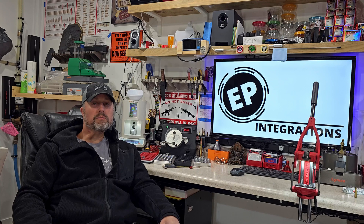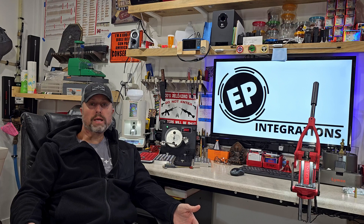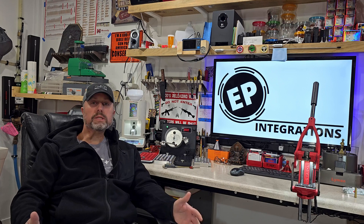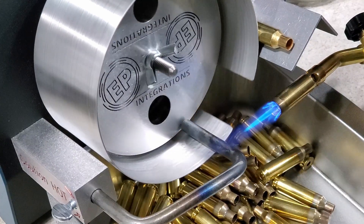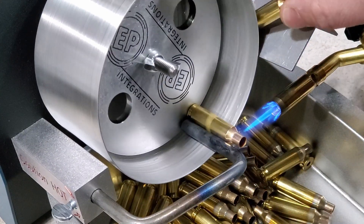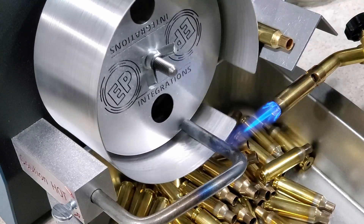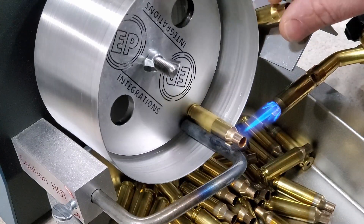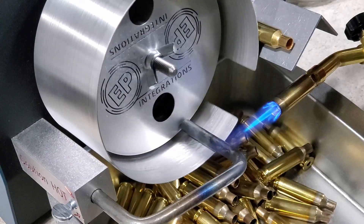In the grand scheme of things, from start to finish of your reloading process, it really doesn't take that long. For example, your average piece of brass getting annealed takes roughly about six seconds. I'm going to count off this next piece: 1-1000, 2-1000, 3-1000, 4-1000, 5-1000, 6-1000. Roughly six seconds — that's about normal for larger cartridges like this, usually 223 is about five to six seconds.